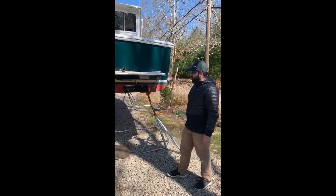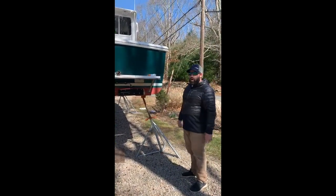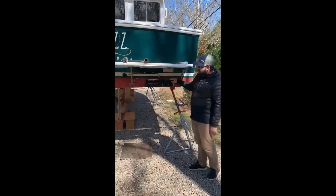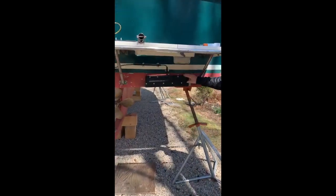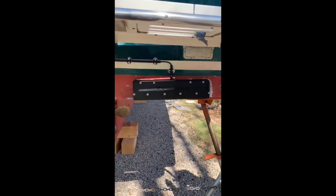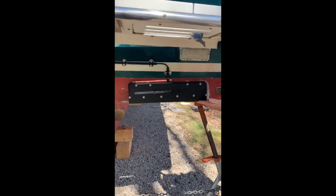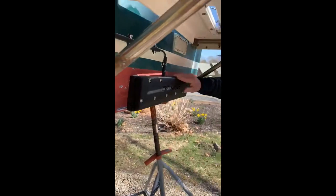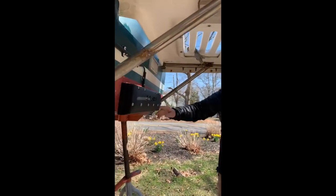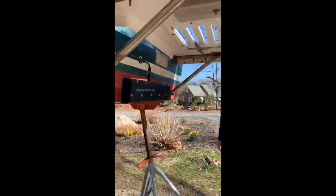Now I'd like to get into boats that are living in the water for the majority of their life. You definitely want to paint these units with antifouling paint. Really important — you don't need to scuff up the units at all. Paint the whole unit. One of the most important parts is where the blade goes on the side and on the bottom — you want to mask that off with masking tape, and then you can paint the units. You don't want any paint going inside these internal moving areas and causing friction. That's a really important thing to keep in mind.